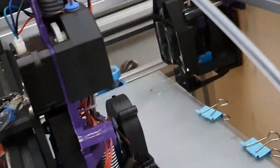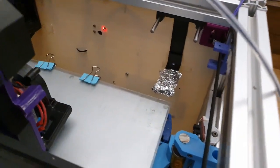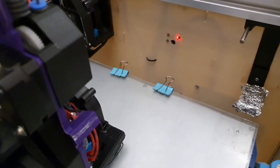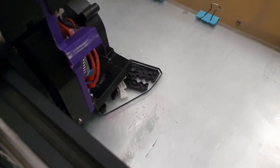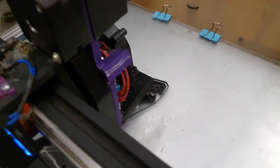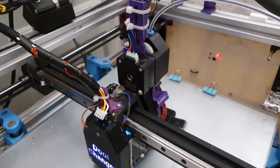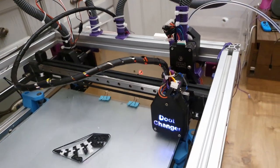What that's gotta do is fix a big flaw with this idea, and that is that I'm only covering the top and the bottom, and the inside is just not getting any fiber. So that's not good. So hopefully if this idea works, the toolchanger will have a resin injection tool that will fill the parts with resin. Obviously I couldn't even break the z-axis anyway like this with only the top and bottom, not on the sides, but I have a feeling that if I put the resin inside too, I'm gonna have insane Z strength and insane XY axis, and this will be automated, so you don't have to deal with all the crap. You just fill the syringe with resin and let it go.